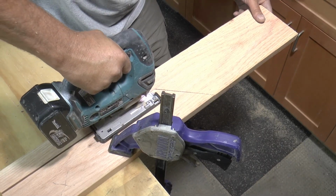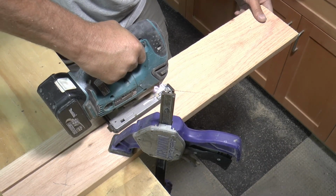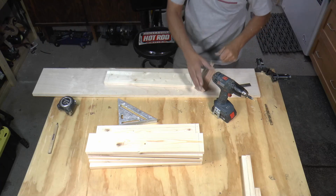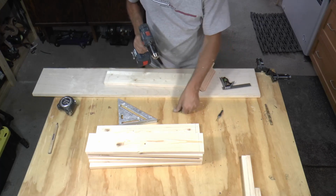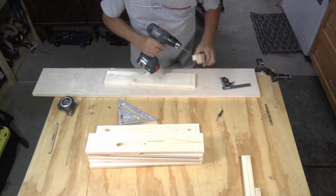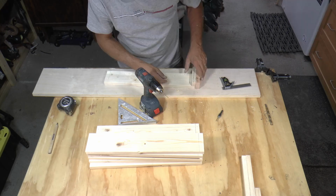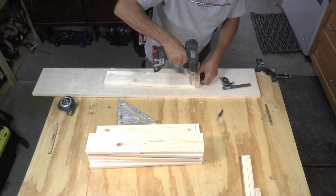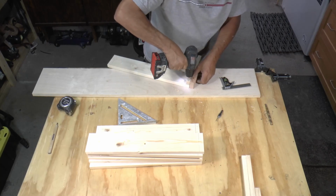The assembly at this point is actually really basic. All the joints will be butt jointed together and fastened with glue and screws. Don't need mitered edges on this build as it is 1, just a dog bed, 2, we're going for kind of a rustic feel anyhow, and 3, we'll be finishing it with a whitewash finish which will hide any imperfections as a result of using butt joints.